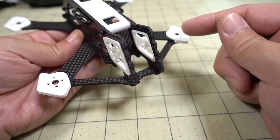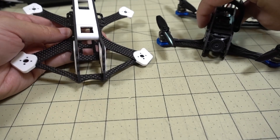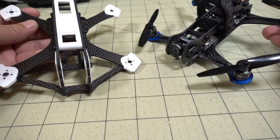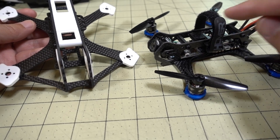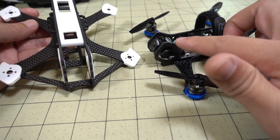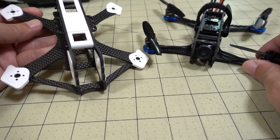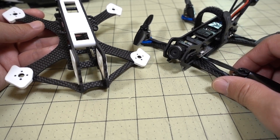That's one of the things I didn't like about the El Camino, which is mainly what this frame is based off of. You've seen this one on my channel before — it's another TomoQuads design, and I've flown it quite a bit. One of the things I don't like is the jello that this frame produces. In this case it's the Turtle camera, and the Split Mini is the same — they're both vulnerable to vibrations from the motors.